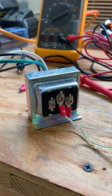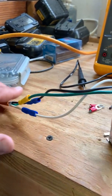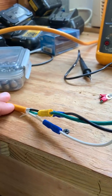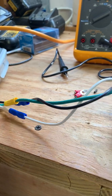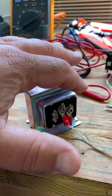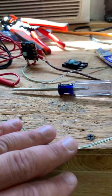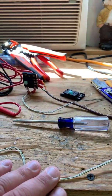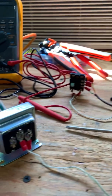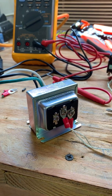It's cheap and inexpensive — I got it at Lowe's last night for 16 bucks. All I did was wire it into an old cord, which is how you'd wire it into a house anyway. Forgive the mess, this is just temporary testing. The doorbell transformer steps down from 120 down to about 18-19 volts on these two lugs. I know the wiring looks horrible, I'm just doing some testing. I ran it over to the switch machine, tied it in, and it operates just the same as if you pull it off a power pack. For 16 bucks, I hope this helps somebody out there — I wish I would have had a video that told me this. Hope you have a good one, thanks.